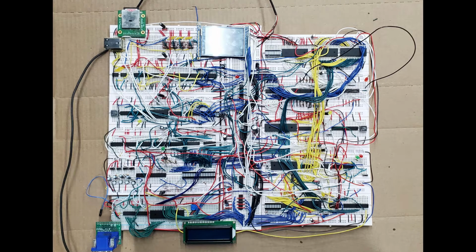The brief technical specifications of the board are as follows. It has, as I said, a 65C816 16-bit processor, which has a max 14 MHz factory clock rate, though the maximum I'm able to get on the breadboard is 5 MHz, and it may have to go even slower as more hardware is added. It has 64 kilobytes of static RAM and 32K of EEPROM.